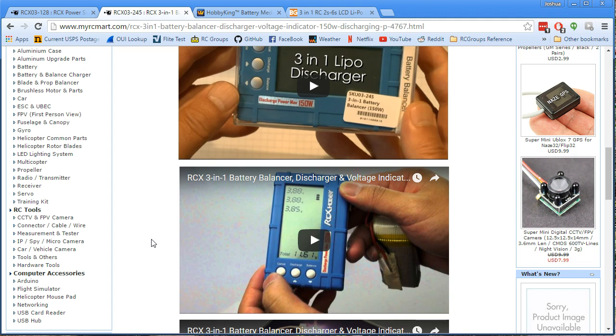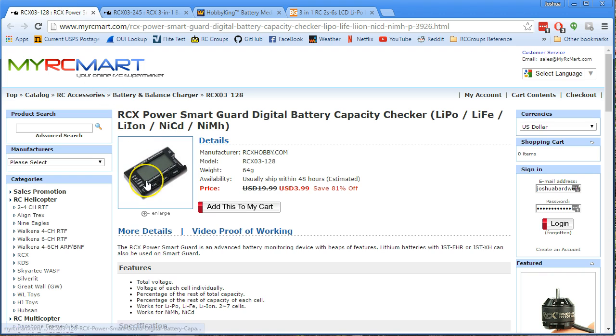But this one is better for a couple of other reasons as well. This one only reads the cell voltage when you first plug it in and then it freezes — it does not do real-time updates. At least mine doesn't. Somebody's going to comment and say, 'What are you talking about? Mine does.' I have this exact one and it doesn't. And I learned that the hard way when I plugged a battery into a light bulb to discharge it. I plugged this thing in to monitor the voltage, came back 15 minutes later and it still said the same voltage as when I plugged it in. I could have destroyed the battery. So this one does not do live updates.